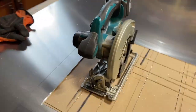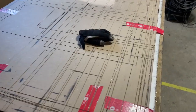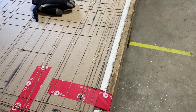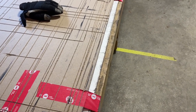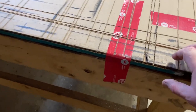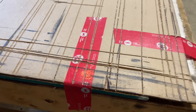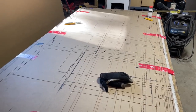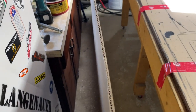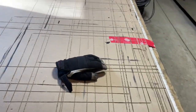In general, I cut everything with that little circular saw. As a work table, I do have a work table in my workshop which has a white wood surface. I do not want to wreck that table completely, that's why I decided to put an OSB layer on top of it — just loose, rested on top. And then one cardboard layer, I taped it on top, as you can see. The cardboard came with the aluminum on top of the pallet — it's a quarter-inch thick cardboard sheet. You can see the multiple cuts in there, and that worked out really, really well.